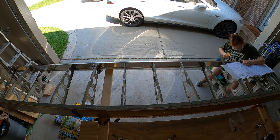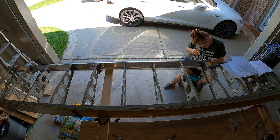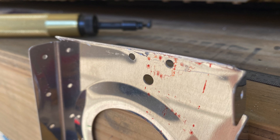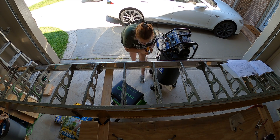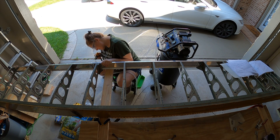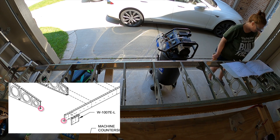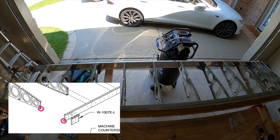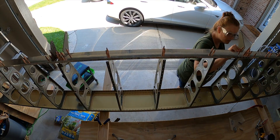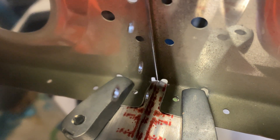There's one other area in 15-4 step one at the very last sub-step, where you final drill number 40 the holes common between the lower rear spar web flange and the ribs' lower aft tab. If you remember from the wing ribs section, we cut the aft flange off the outermost wing rib on both wings. So the only thing currently connecting those outermost ribs to the rear spar is that one little lower aft tab hole. I got them aligned and used a cleco clamp to hold it for drilling that one hole.